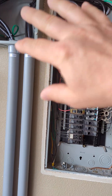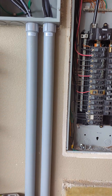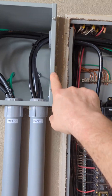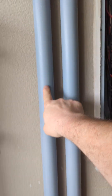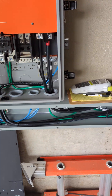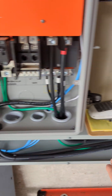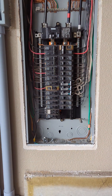This is the inside. We have all our covers off; we're getting ready for inspection. We have all copper conductors. Our challenge was getting from inside the wall to outside the wall so we could go surface mount. We just got a deep box, recessed it in, nippled through the side. So we're coming from the meter main outside in, down our conduit, over up into the grid location — what is marked 'grid' on the Flex Boss. Then we come back out of the backup load, comes in, up, terminates on the breaker. Separated grounds and neutrals.